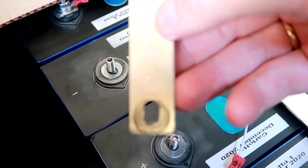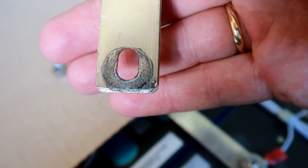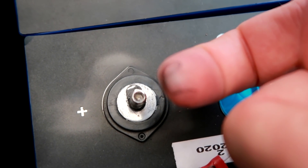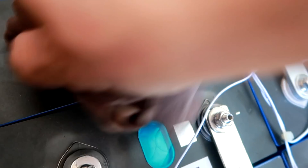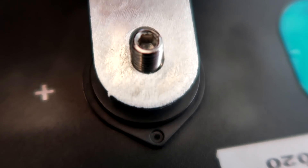You can see the remainder of the grease underneath. I'll just disconnect the BMS. Here you can see the carbon grease on the bus bars, both ends, and also here on the terminals. People have actually left comments about this grease which you can buy at J-Car here in Australia - they did some testing and said it's not conductive at all. It has a fairly high resistance and therefore is probably not ideal to put on electrical contacts. I'll take some alcohol now and wipe this all off. Look at the size of the bus bar and the size of the terminal - it fits perfectly on top and covers the whole terminal area. And I have enough play here to actually space out my cells.